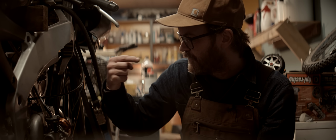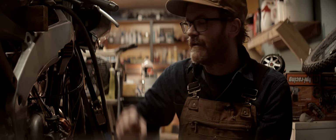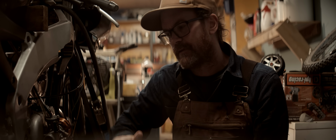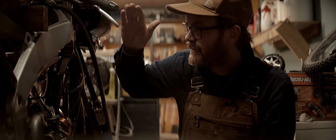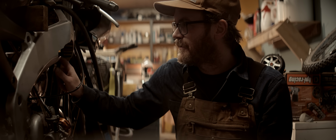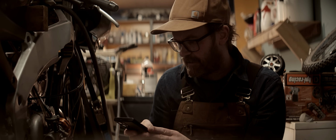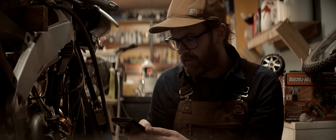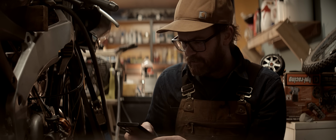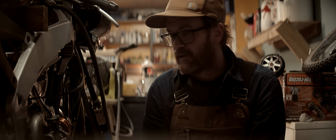Maybe there's too much short-circuiting because the wrist pin hole is passing over. I think there's like 7, so 14 millimeters from 7 millimeters before top dead center to 7 millimeters after top dead center, where there's communication between the A-transfers and the exhaust port. I'll show you this later in CAD, but I'll just quickly check how many degrees that corresponds to. That's actually a lot around top dead center.